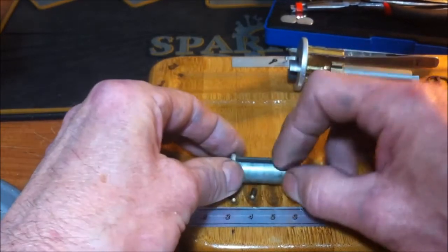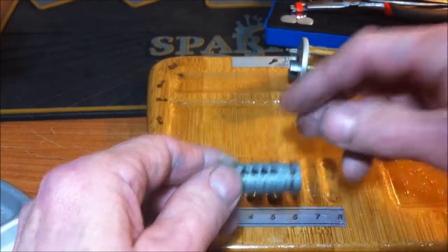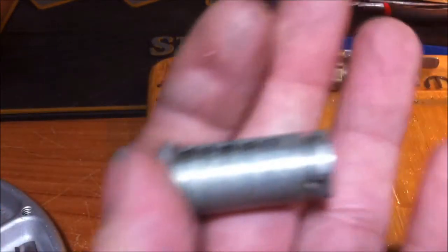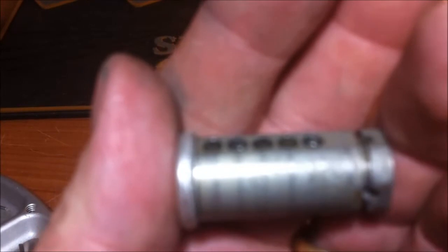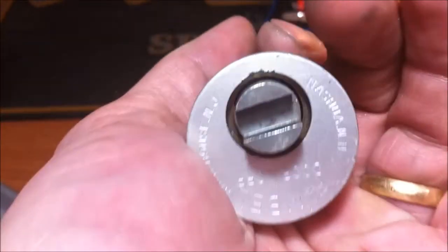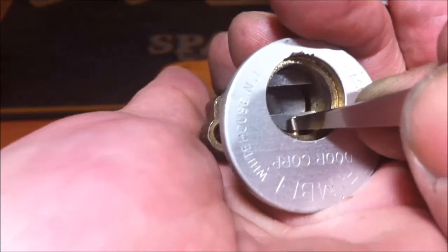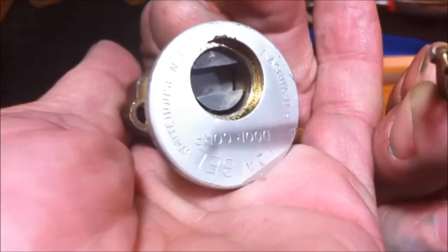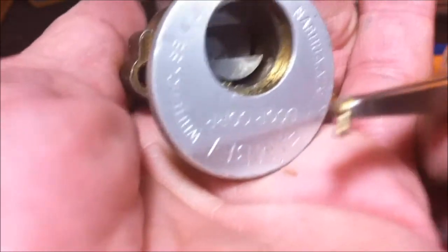And these pins do not like to come out of here. I'm going to bang it on my desk. Sorry about that. I should have actually used a pick to get it out of there because we have some threading. See if I can focus it for you. Come on. It doesn't want to focus too good. We have threading in 2 and 5. Alright, see what we got up here. The follower's pretty loose in here. Okay, we have a T-pin. Well, look, it's a drunken spool, kind of, sort of. There's another wafer in there. You can see it's beveled down too.